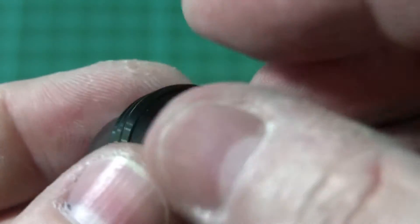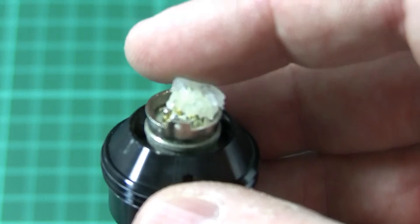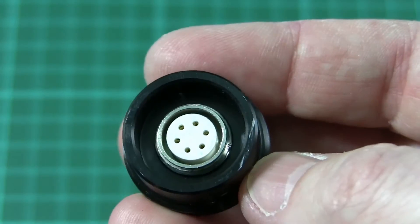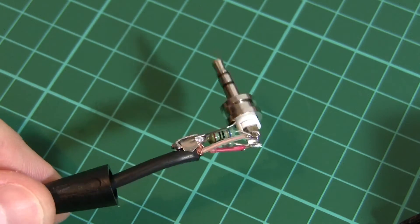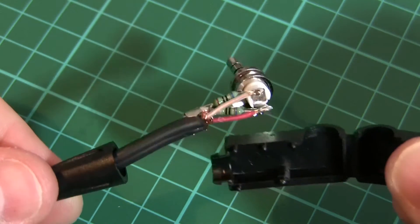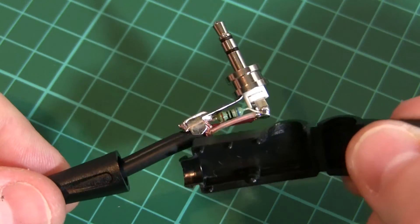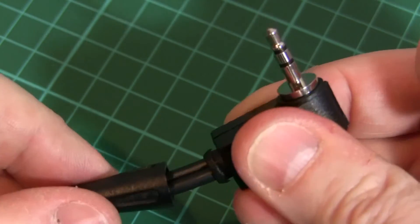After digging down even further I've finally exposed the pins. Having cleared the last of the white potting compound out of the bottom of the connector, I've exposed all the pins and I'd be quite happy to solder to them. Here's the three-and-a-half millimeter stereo mic plug — you'll notice that we've got the 680-ohm resistors bridging the left signal and ground, and the right signal and ground. The strain relief isn't very adequate so I might put some epoxy or silicone sealant on there before I finally seal everything up.